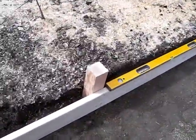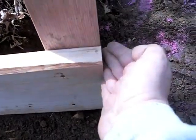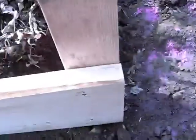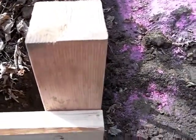We're going to continue on. The second course is going to be extremely easy because it just goes right on top of the first. However, I am going to log cabin the corners, meaning this seam right here will overlap — a board comes this way flush, and then the next time this board stops shy. I'm just going to log cabin the corners: this one will go slightly past, and then this one would start on the inside, just like it is now.